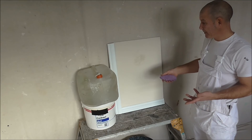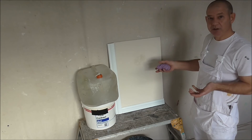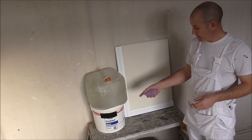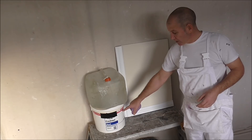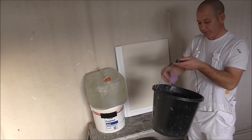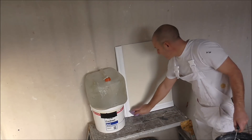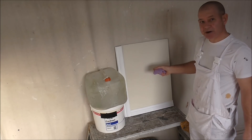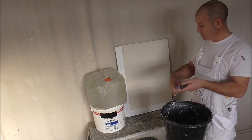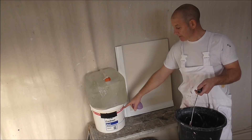If you do move into a new build property, then on your ceilings, in your kitchen, and in your bathrooms, you're better off applying something that's going to resist the steam and moisture. If you do use this method, then what you'll need is either to carry an empty container like this round with you, or two buckets — one with fresh clean water, because you will need to wipe down all your surfaces as the spray off this is unbelievable — and a second bucket to use for mixing. That's if you're not going to carry all these, as it's easier mixing in a bucket than in your paint scoop.